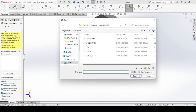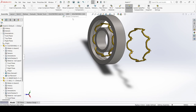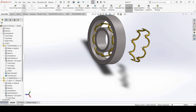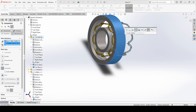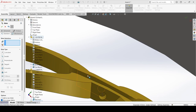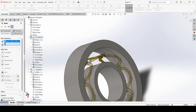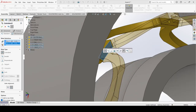Now insert Cage Number 2. Select Rotate Component and rotate it appropriately. Now go to Mate. Select the outer face and select this one, and select Concentric. Apply OK. Now select this face and this one and apply OK. Select this face and apply OK.